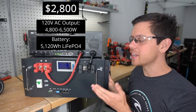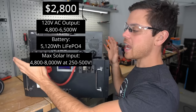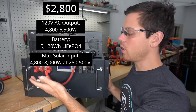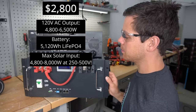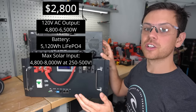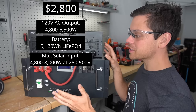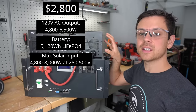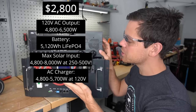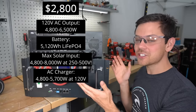The battery capacity of this server rack battery is 5,120 watt hours — for the money with lithium iron phosphate you can't beat that. The max PV input of the solar charge controller is 4,000 watts for each MPPT, which is 8,000 watts with two separate solar panel arrays, though with a single battery the max input is 4,800 watts. The max input voltage is much higher — even a basic LV6548 can handle 250 volts; the 6500EX does 500 volts compared to the EcoFlow Delta Pro's 150 volts. The built-in AC charger can charge at 5,700 watts, though limited to 4,800 watts with a single battery — still way better than the EcoFlow Delta Pro.